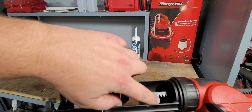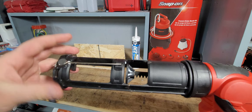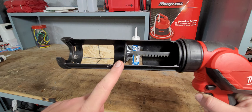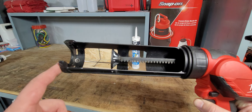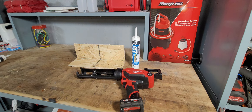The tube here does spin; the body doesn't spin because it has the teeth on it, as you can see — so the whole tube will spin. You can see the auto-reverse: as I push it in, it comes back, so there's no dripping at all, which is really nice especially if you're up on a ladder or doing trim caulking in a house that's nearly finished and you don't want any extra cleanup.